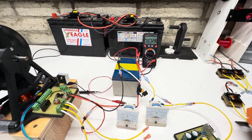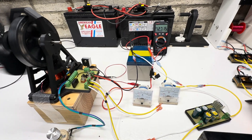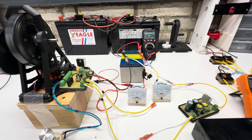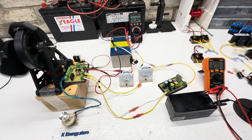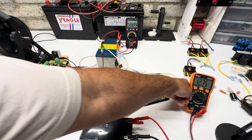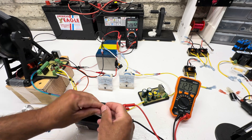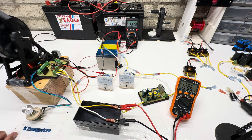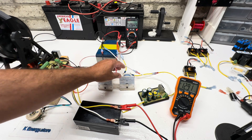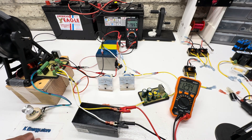Our output back to the primary battery is about 600 milliamps at 14.5 volts pulsing back, which is really cool. If you don't want to charge a separate battery and just want to sit on one battery, you can do this — the battery kind of settles out and goes up and down with the charge, so it'll run a long, long time. Now if you hook the secondary output up to a second battery to charge while on generator mode, as soon as you connect it your battery starts charging, and what remains on this side is about a 5-volt square wave.